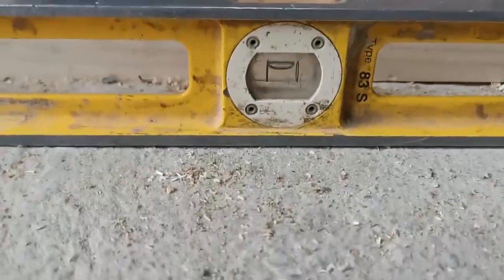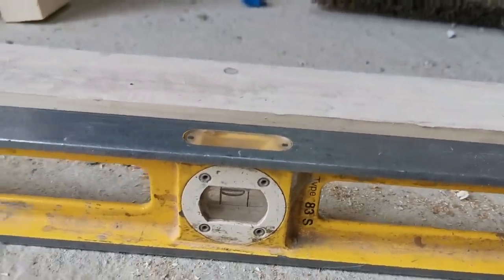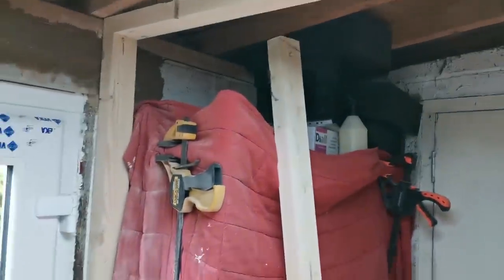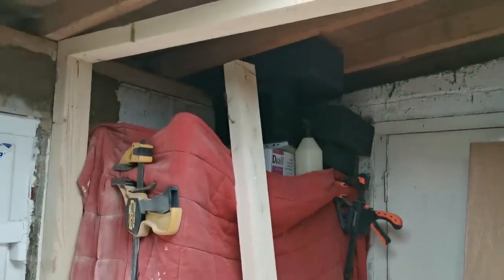The floor is sort of level — it goes up just by 5mm or so that way. That is 2,022 there, so I think what I'm going to do is just put another one in the head. That will give me a good 15-20mm clearance so I can get the top of the door frame level. I need another leg there, and I might have to put another one in — I might put two up the side of the door frame anyway, just to stiffen it.